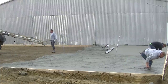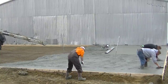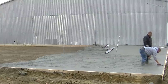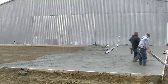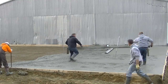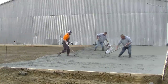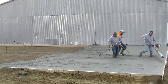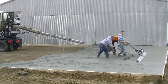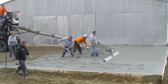You can see I just got my wet pad made. Now we're going to strike those edges as soon as we get the boards all magged off, get that second truck out, then move the third truck in. That's how we continue the process — about 20 minutes into the pour already, two trucks out. I'm going to get them leveled right off. That Screed Demon works really well for screeding concrete.